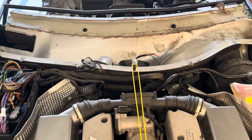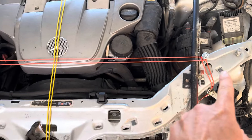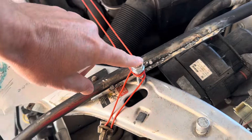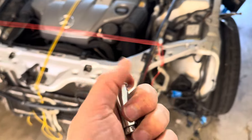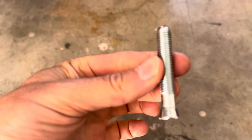I found a few spots that will work as pickup points. One is a center nut plate hole for this cover, and then there's a point right there and a point right here. We use those two points, and then of course the center point here. I use these anchor bolts — they're Home Depot anchor bolts. What's neat about them is they have a tapered end, so they're self-centering to the holes as you tie them up. So I thought, okay, let's use those.